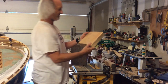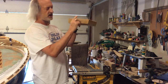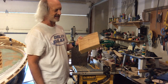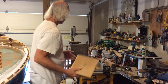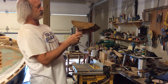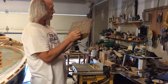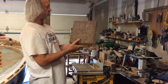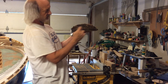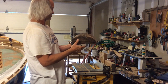So I started looking around to see what else I have. I found this — another piece out of the tree. Most of the sapwood's cut off, it is 2 inches thick, but it's got a bit of a bow to it and it's not 9 inches — it's like 8. So that's not going to work. Then I had this other one that I've actually been using to hold the garage door up. It's got a little tiny check right there but I don't think it goes very far. This piece is at least a foot long and I've got plenty where I can get 2 inches out of it — in fact it's about 10 or 12 inches across here so I think I could actually get 2 pieces out of here.